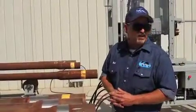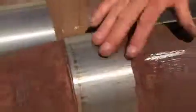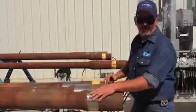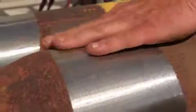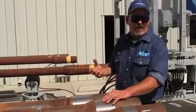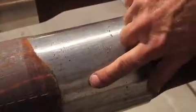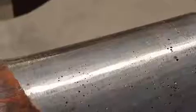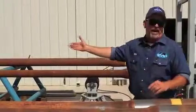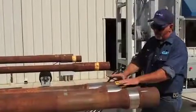Let's talk for a minute about some of the reasons why we may want to remove a hard band. Sometimes, depending upon the type of drilling they're doing, they want you to apply a hard band and then just slick the top of it off — this machine will do a fine job of that. Another example would be the removal of a hard band down to your parent metal, so you can change the type of wire on there if the hard band isn't right for your drilling application. We can also grind out impurities in the metal of the tool joint. This material right here needs to be ground out some more for proper reapplication of a hard band. The machine is also able to complete the center wear pad of heavyweight drill pipe on both ends.